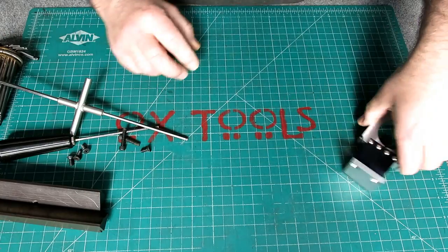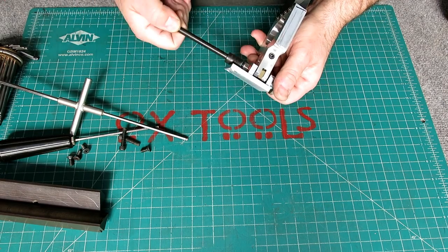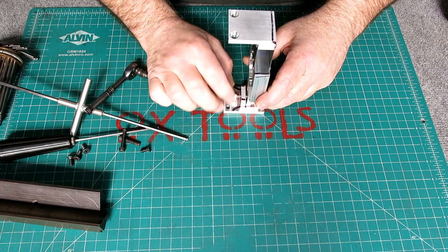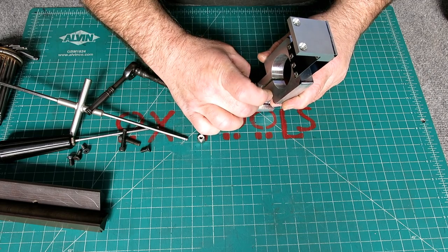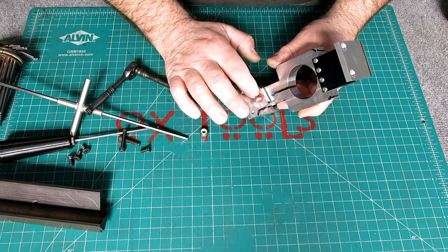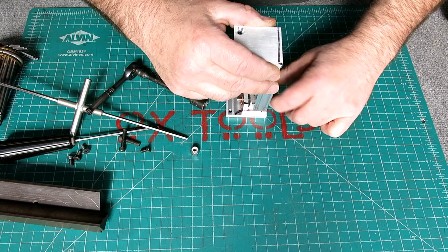Okay, so let's set that aside. Now then we get the main thing here. It's got a trap nut assembly here. It's got a little lock nut on it. Right there, you can see the lock nut. It's just a nylock. And then here's a fiber washer. So what I can do is adjust the preload with that against that fiber washer, and I can take out all the slack, but then it still rotates smoothly without gouging the aluminum. So that's the idea behind that.